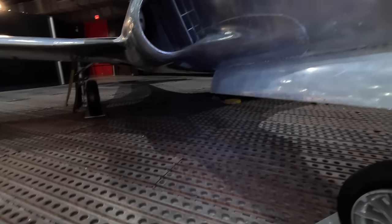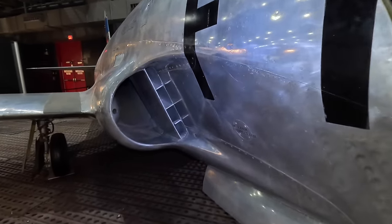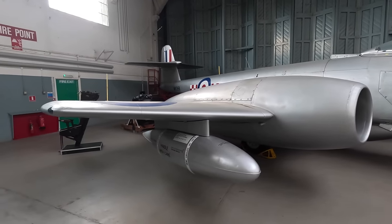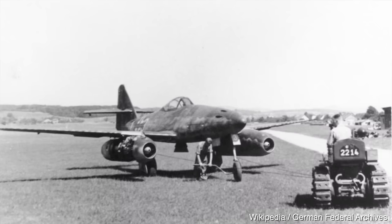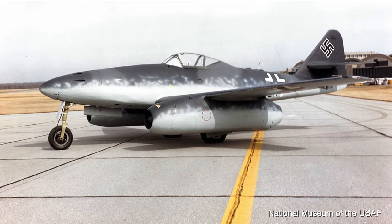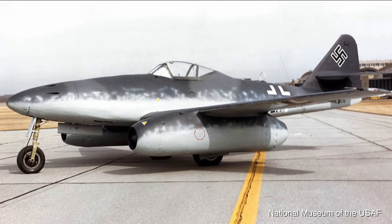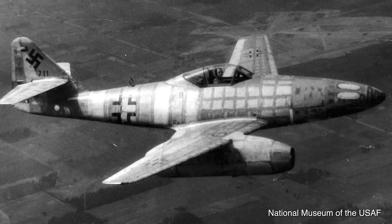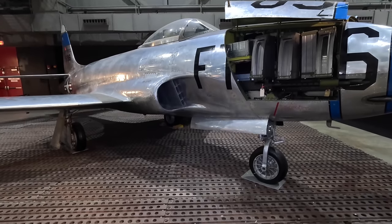Moving up, we have the side-mounted air intakes, which were actually advanced for their time. Jets like the Gloster Meteor and the Messerschmitt 262 had two wing-mounted engines, with the benefit of additional thrust, ease of access for maintenance, and because uncontained engine failures were more common back then, any potential explosion would be further away from the fuselage. But they did require much stronger and heavier wings, produced a lot more drag thus slowing top speed, made the wings less efficient, and consumed a lot more fuel. Eventually jet engine technology improved so they were powerful and reliable enough to only need a single engine, and that's what we see here.